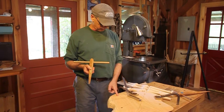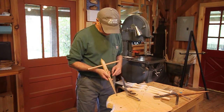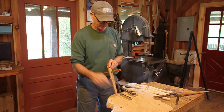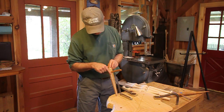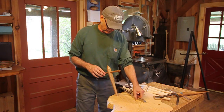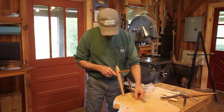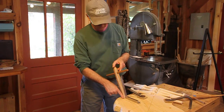This was 24 point something. I forget, 24.6 or something like that. And so you could set your bevel square up for 24.6 and read off of the blade, but the blade would then have to be turned dead perpendicular to this to get an accurate reading. Or you could have a long bevel square and read off of this right here, which is parallel, okay, at that 24.6. What I prefer to do is subtract 3, since this is a 6-degree reamer. 1/2 of 6 is 3, and so I subtract 3, and so I put this at 21.6, and then I can read off of the front of the taper right there, okay?